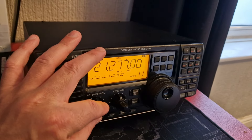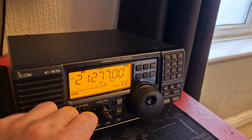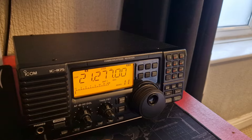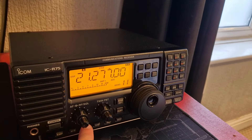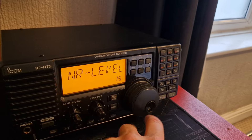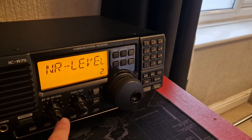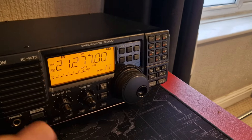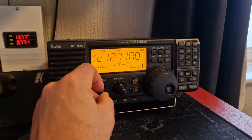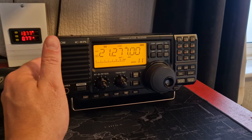This also has a decent noise reduction — it's only in the audio stage, but I mean, where else would you put noise reduction? You could put it in the IF stage. It's adequate noise reduction. The thing I'll say about it is, if you hold it down, you've got zero — which is honestly pointless, because that's just off — up to 15, which is an odd number. Since zero doesn't actually do anything, I'd say the sweet spot is between two and four. If the sweet spot's between two and four, what would be the point in going up to 15? There isn't a point — it should just be one to five, which would be sufficient for this DSP noise reduction.